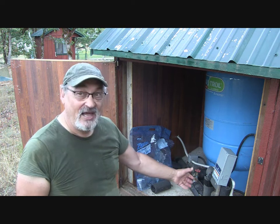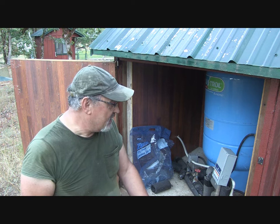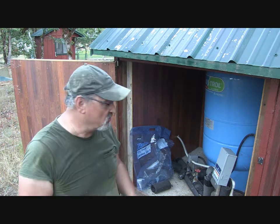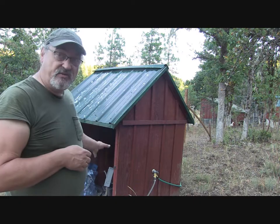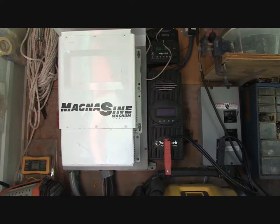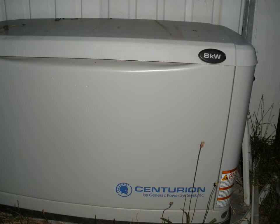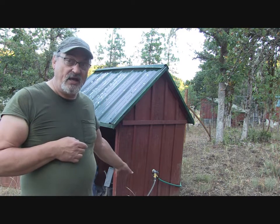Now I'm going to reconfigure this whole thing to get ready for going completely off grid. My well pump is down the shaft and runs on two-phase 220 volts — two 110-volt legs plus a neutral. The wiring runs through a conduit underground into the service box next to my shed, where all my solar package is: the charge controller, inverter, generator, and batteries. My solar package only runs 110 volts at 4,000 watts — it doesn't run 220.